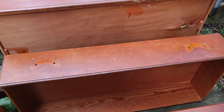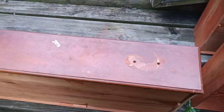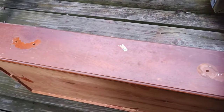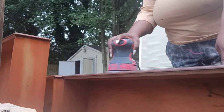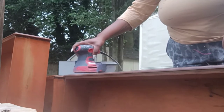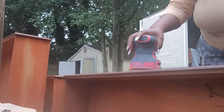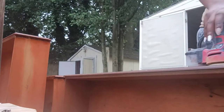Here's how all the drawers looked once all the hardware was removed — I'd already cleaned them off — and now we are ready to start sanding. I'm using my sander and 220 grit sandpaper and I am just going to make quick work of removing all of that failing top coat and any residual dirt off of all of my drawer fronts.